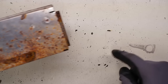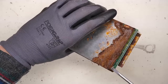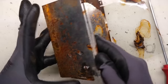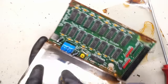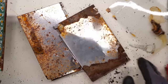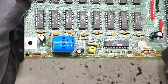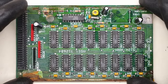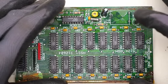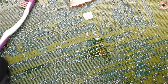This thing is like raining debris out of it. There's no chance of any kind of desoldering action on this, so I'm just going to have to get a pry bar and just pry it apart. Oh, it's so crunchy sounding — there's so much debris in here. The board is free and this is, as expected, a rusty mess. There's that nickel cadmium battery there — just a tiny bit of corrosion, but I've seen far worse. I scrubbed the RAM expansion board with some IPA and dripped some vinegar on the battery leakage area. For the motherboard, I'm going to use some WD-40 and an old toothbrush.